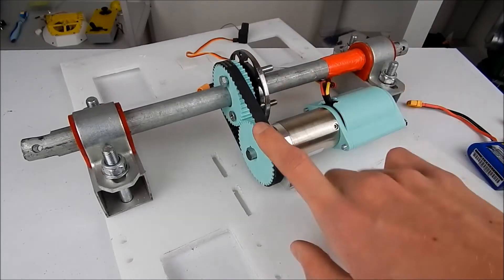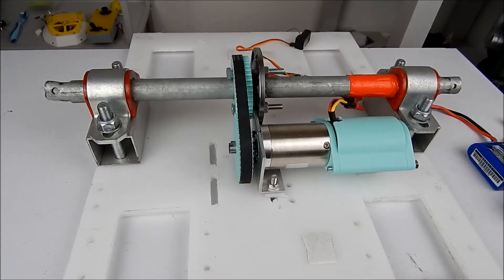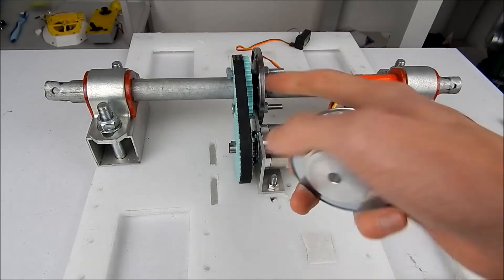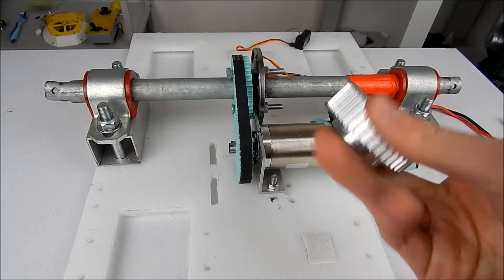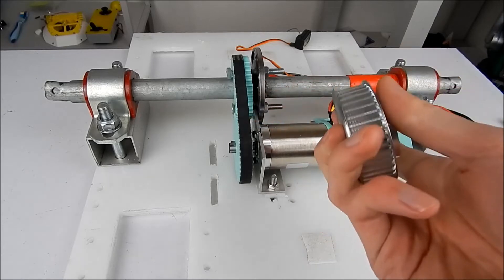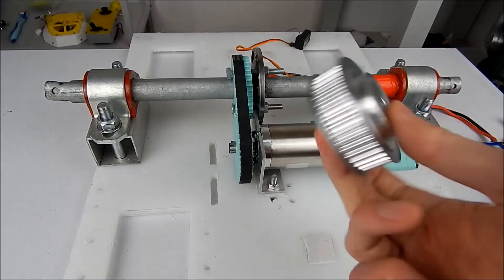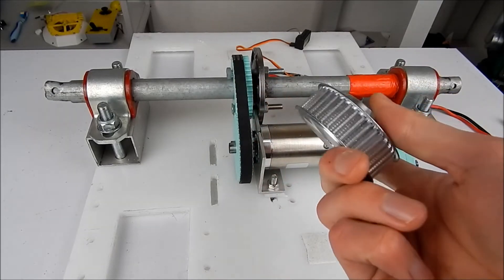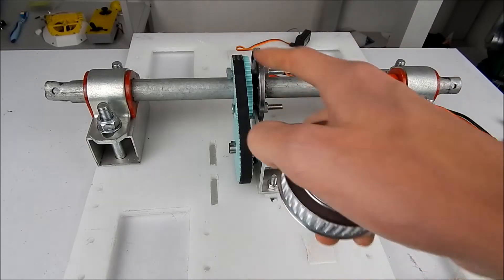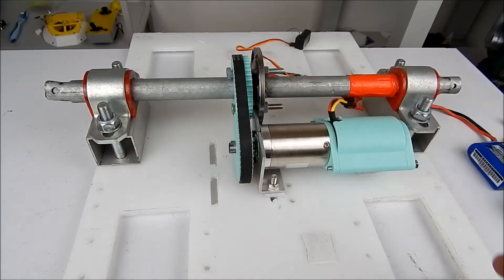A lot of this stuff is very temporary though. The gears in here are all just PLA gears at the moment. I got my nice shiny aluminium gears, but these are actually bigger than the 3D printed gears I have. They're supposed to be the same pitch and the same number of teeth, but these ones are bigger and don't actually fit these HTD belts that I have. I'm assuming these are 5mm pulleys rather than 5mm HTD pulleys — I didn't think there was much of a difference, but these do not fit. And I'm also kind of running out of time to get more parts because shipping in Australia takes a long, long time, so we might have to keep running with the 3D printed ones.